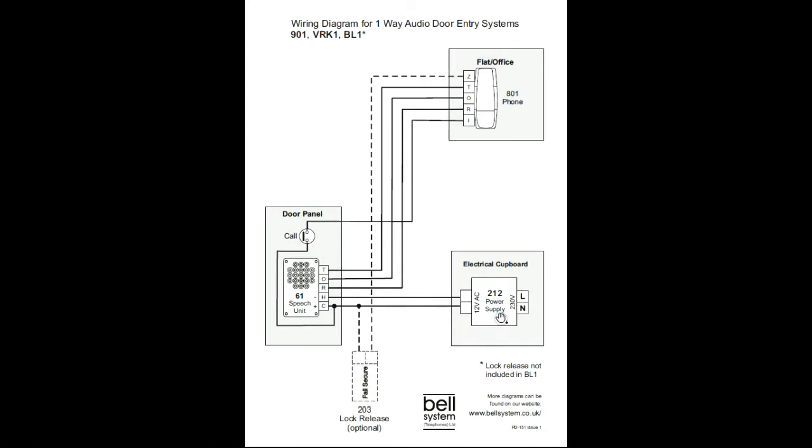So that's the problem: if you've got an intercom which is powered off AC and a keypad which is 12 to 24 volts DC, there's an incompatibility there. That's where the relay comes in. On the relay you have the coil terminals — positive and negative input. In our case on the VHLR it just says 12 volts DC input, and that's where these two wires come in.